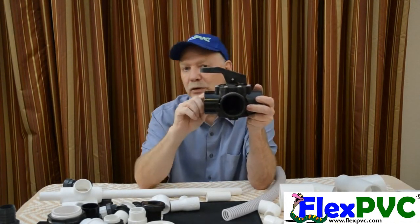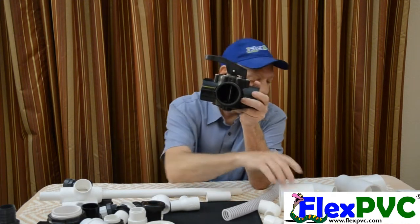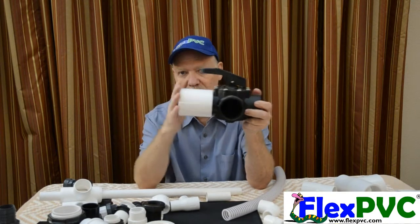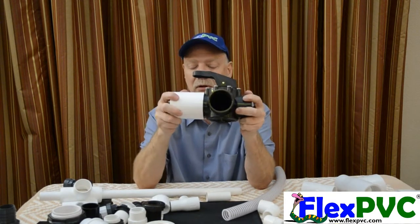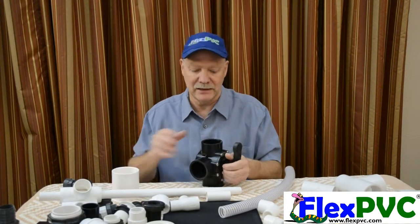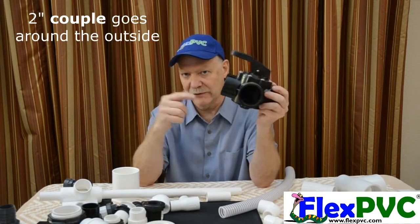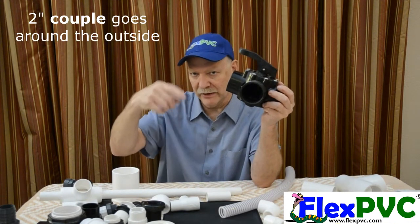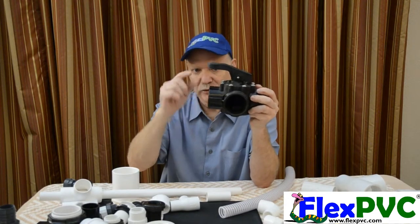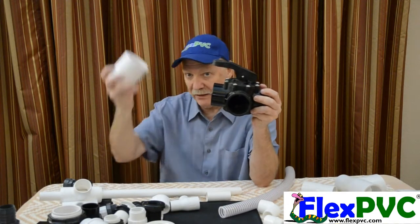But this is also a two-and-a-half spigot, meaning a two-and-a-half-inch socket will go over it. People love this valve but they want a bigger one. Unfortunately, they don't make a bigger one — they make an inch-and-a-half and two, and that's it. The inch-and-a-half goes inside, two-inch goes around the outside. This is a two-inch — two-inch pipe goes inside, two-and-a-half socket fitting goes on the outside.